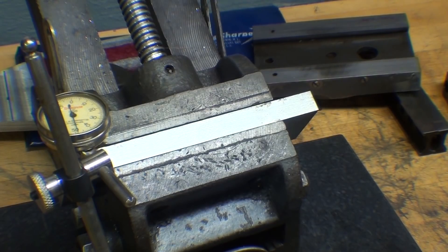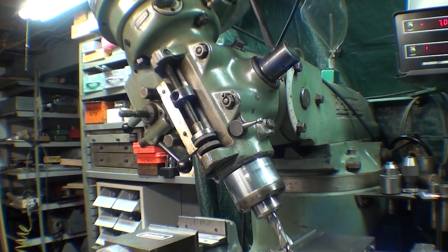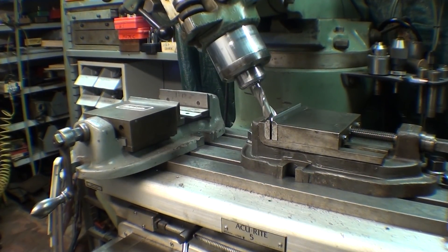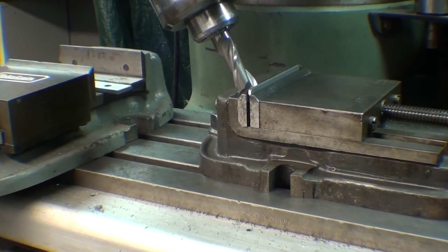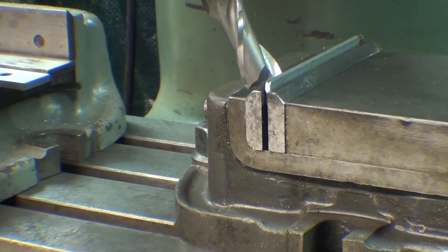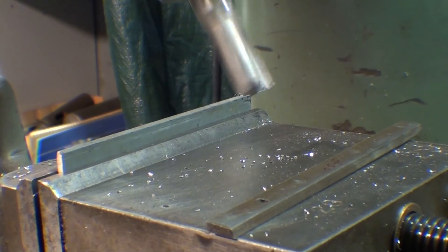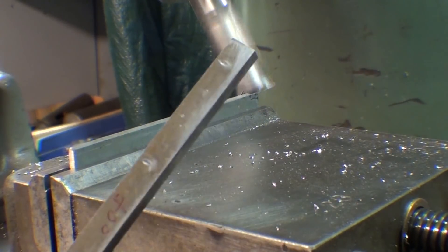Let me try to do it right. Here's the way I should have done it in the first place. I do have the head tilted 30 degrees off to the left. The reason I avoided this the first time is I'd rather take a good proper caning than have to deal with tramming the head in again, even though I have all the proper equipment. So I switched to a Brown and Sharp vise — raise your hand if you think I can count on it for accuracy. There's a wavy parallel in there, so I'm back to square one milling off the one side. The only scrap I could find had paint on it, so I'll have to deal with that later.